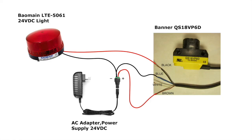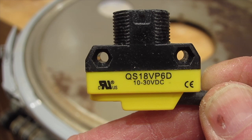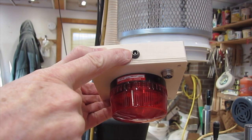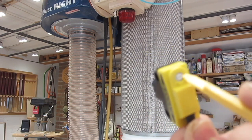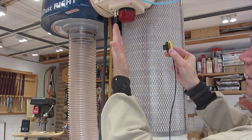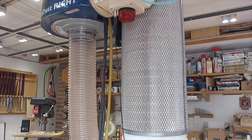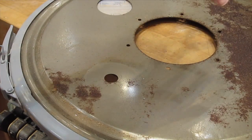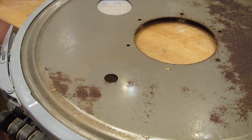The only critical component here is the Banner optical level sensor. If you use a 12-volt light, get a 12-volt adapter, and the light should draw no more than 50 milliamps. I ordered this Banner optical level sensor on eBay directly from China — it's cheaper that way. I've got a connector to the level sensor, a connector to the 24-volt power supply, and the wiring inside. There's a little range screw on top of the Banner sensor that I adjust so the light comes on at about 5 inches from the top, giving me a signal when sawdust is about 5 inches from the top of the bin — I don't want to go right to the top or the sawdust would come up through the cyclone into the filter. You'll notice this lid has gone rusty — I made the mistake of storing it in my crawl space. It doesn't affect functionality, but something to be aware of.